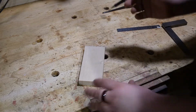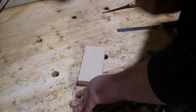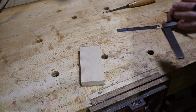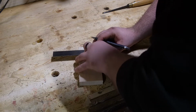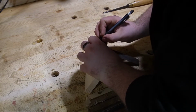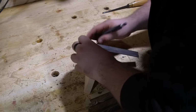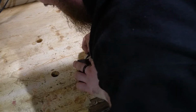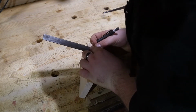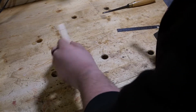So if you've watched my videos before, you're going to know what's coming next. The important thing to getting this consistent all the way around is to come off the same faces. So I'm going to mark my face side and face edge here, and that's where I'm always going to bring my line from, with my ruler and my square. So I'm just going to square this line all the way across, keeping to those faces. And if we've done that right, no matter how off square our material might be, we should end up with a perfectly jointed line, which we do.